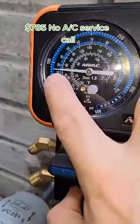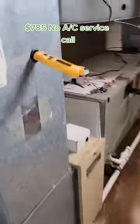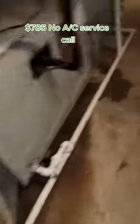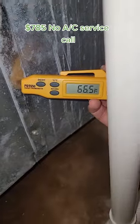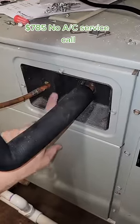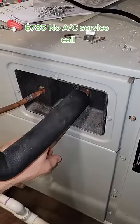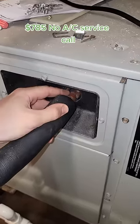This inner number here, between 20 and 30, is the temperature of the indoor unit. If we run over here to the indoor unit, we can see that our return temperature is 80 and our supply temperature is 65 — about 14 degrees difference. That 20 to 30 degrees is the temperature of the refrigerant inside of this coil, which, if we know anything about water, it freezes at 32 degrees.